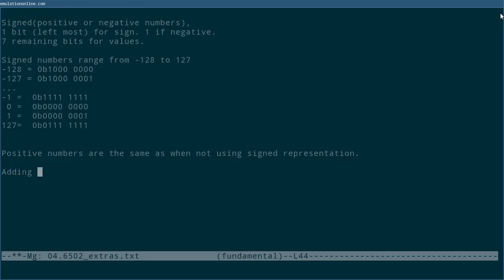Let's take a look at what happens when we add negative 1 and 1, both represented with 2's complement. Here we have minus 1 and 1, and when we perform the addition, we see that the leftmost bit — which is actually bit 9 — would be set to 1, and all the other bits are 0. Since we only store 8 bits, we ignore that 1 bit and have 0 left, so negative 1 and 1 gives us 0.